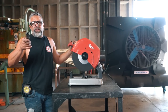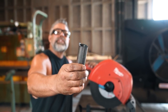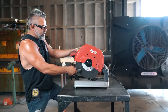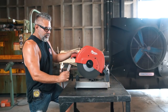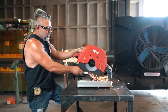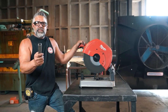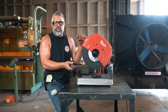The reason why I like having the guard off is you always have this burr on the end after cutting. See that burr? That's the thing about these abrasive saws — they always leave a little burr right there because it actually kind of melts through at the very end since it's so hot. I can clean that up really quick and be ready to weld in no time. That's not recommended use for this saw, but I've learned to use it for a lot of different things.